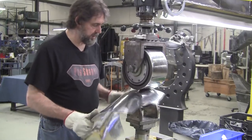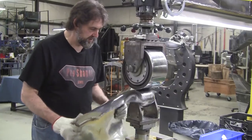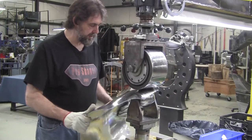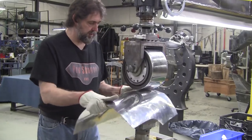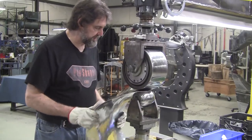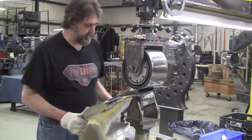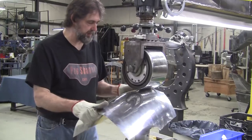Because that's what you're doing when you're shaping metal — you're creating the correct area value. Once you have the correct area value, then you can set the arrangement value, and not until. It's got to be right on the money — it will resist; it won't bend. Setting arrangement is all about bending the metal. Area value is all about shrinking and stretching the metal.